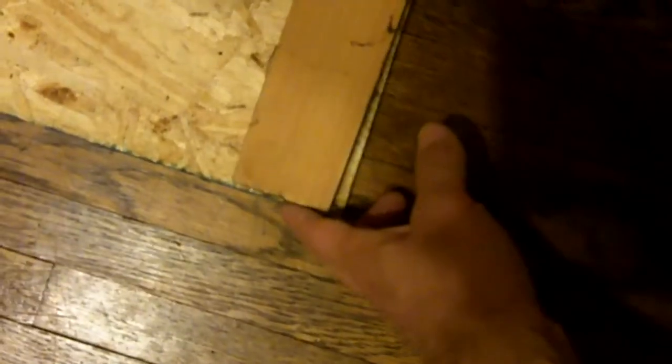All right, so I cut a second one at 20 inches. I actually cut them a little bit smaller than 20 inches, and I put them on the sides. Again, this is the front, these are the sides, and this is the bottom piece. So we put them on the sides. You want this board to be flush with the sides. It doesn't matter if it's flush with the front. It can be a little short like that. You definitely don't want it hanging over the front or the back, though, but it can be a little short. But you want it flush with the sides on both sides.